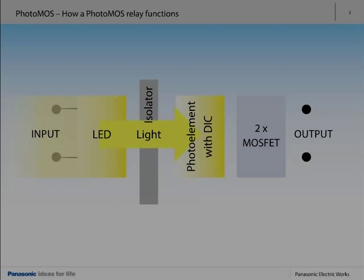The photovoltage provides a trigger that in turn controls the gates of two source-coupled power MOSFETs on the output side. The integrated trigger circuit is activated at a certain photovoltage threshold and switches the output on and off — in essence digitally — to produce a defined switching behavior analogous to an electromechanical relay.